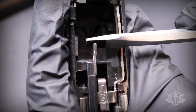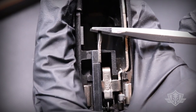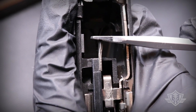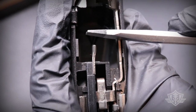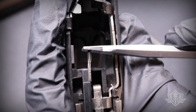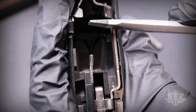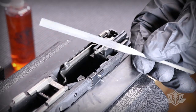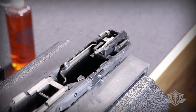I'm going to try to change this angle — give it just a little bit of an outward tilt while maintaining that backward tilt. You've got to be really careful when working on this; don't remove too much metal. But this definitely looks like it could be our culprit. I'm just going to use this small flat file and slowly and carefully work to alter that angle.